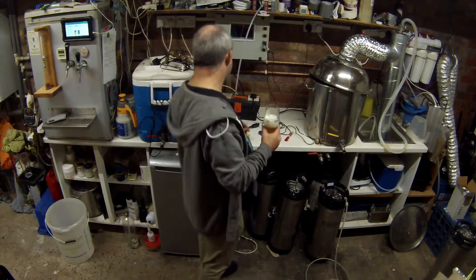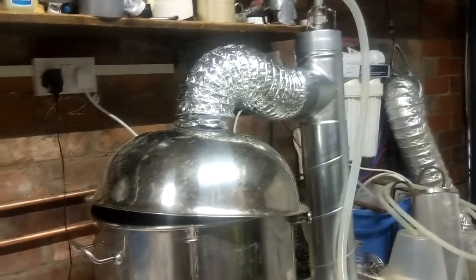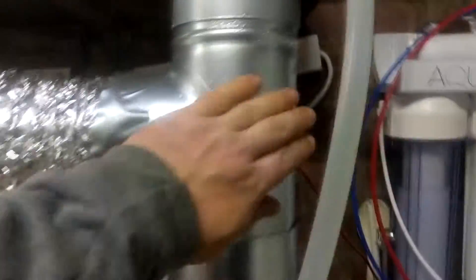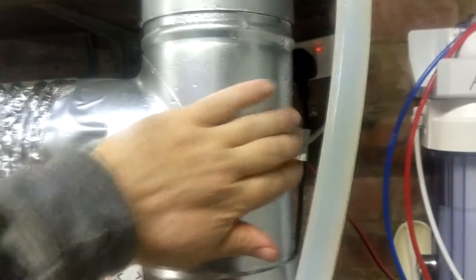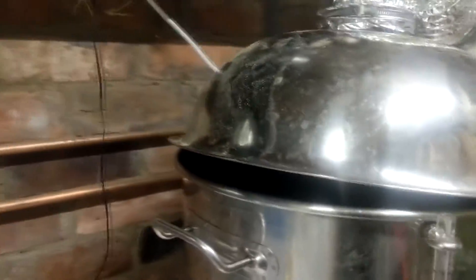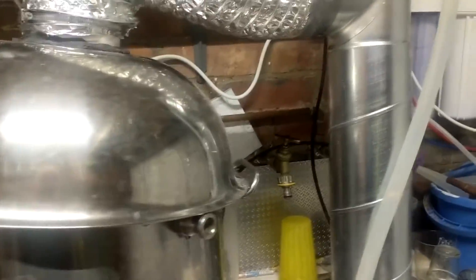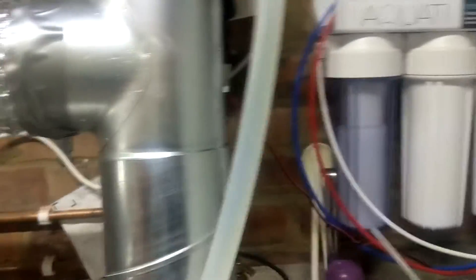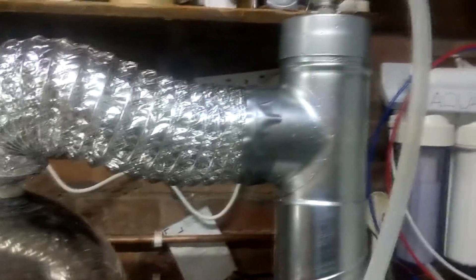We're nearly there, we're at 82 degrees, so hopefully we'll have boiling soon. Okay, so we have a boil — how's it working? Well, still cold up here so it's obviously hot on the ducting. This area is staying cool so there's no steam escaping over here. There's a fair amount of water dripping, we've got a little bit of a leak at the top which I think just needs tightening up. We've got some steam escaping where the hood doesn't fit precisely — a little bit more than with the extractor-based system, I think, as there's less positive airflow. The spray should be drawing air down at least partially, so at least a partial success.